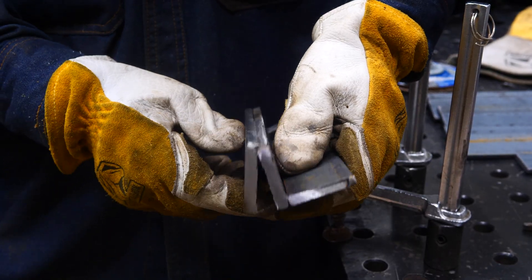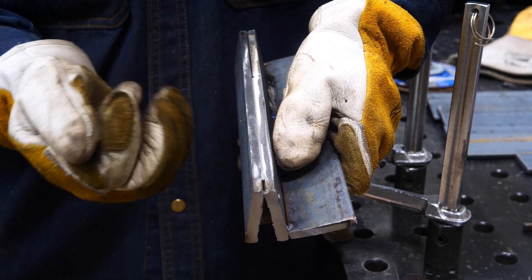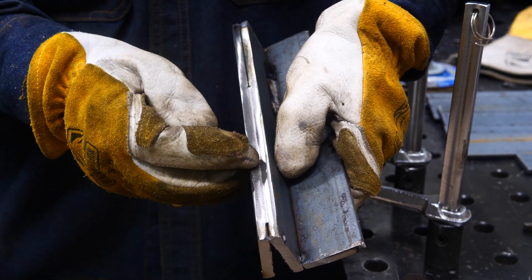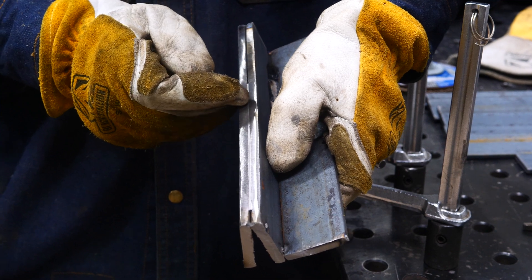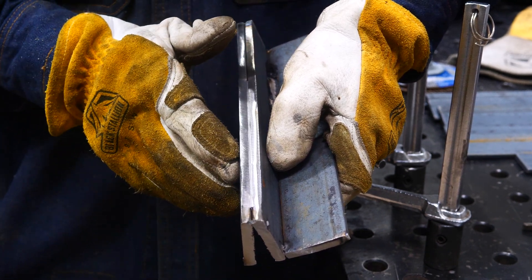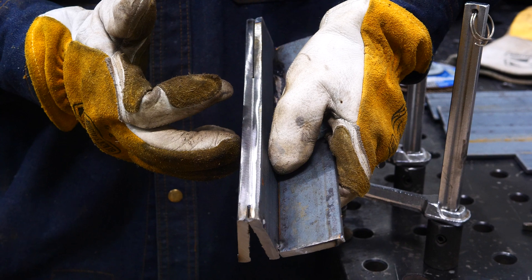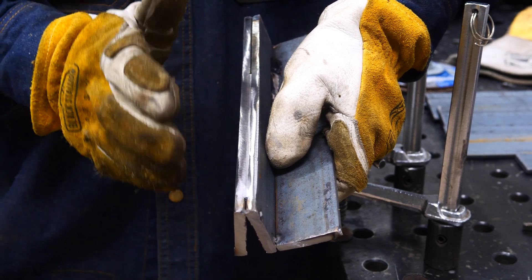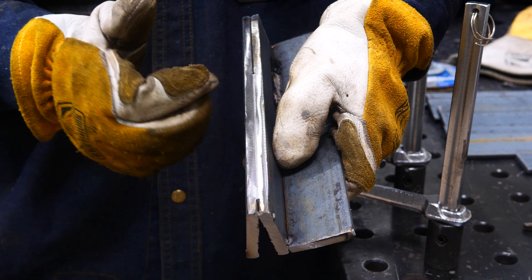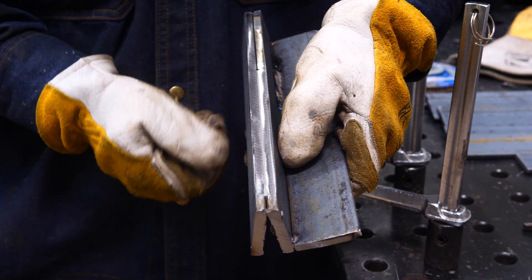Here's the result of a couple smacks with that wedge — you can see how much we've pulled the two pieces apart, and that's not a lot of force: just a wedge and about a two pound sledge hammer. What we want to see is this little crease running down the middle of the weld, indicating yielding right at the center. This would not happen if we had left the throat on. It's already starting to fail with minimal force. We're going to continue by welding on a lever and just pulling it with body weight to see if we can get it to snap.